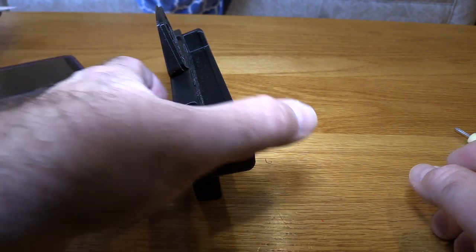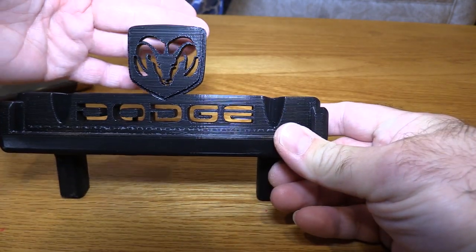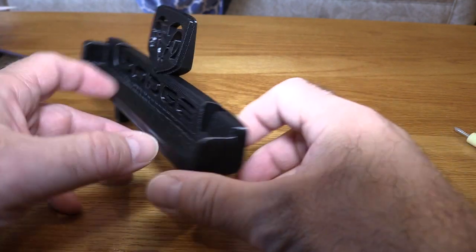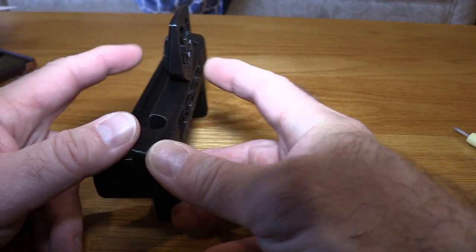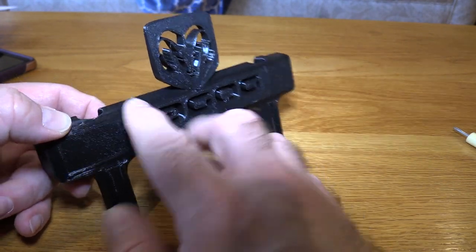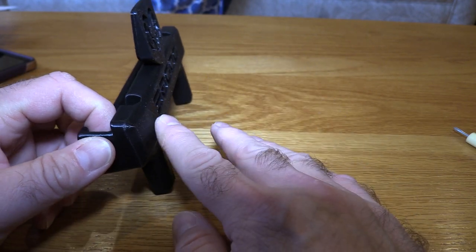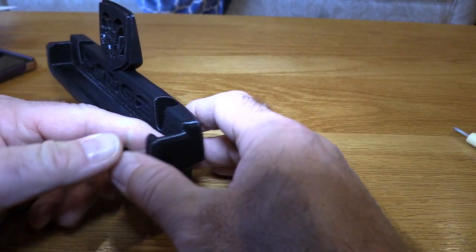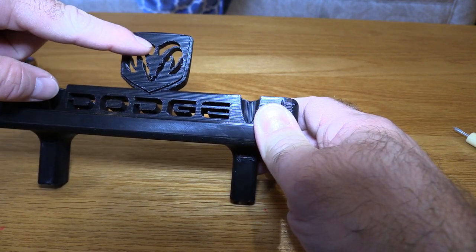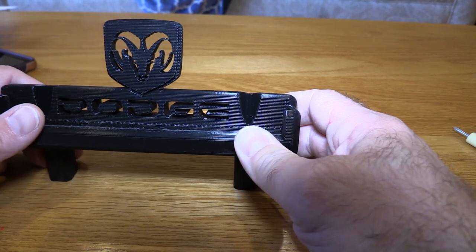Going forward — and I'm calling this next gen again — I'm not going to have this extrude all the way out. What I'm going to do is extrude it so I only need a little material on the back, like a millimeter, so it goes all the way. I'm going to start printing with clear PLA — clear isn't really clear, it's kind of muddy — but I'll start the first few layers in clear so you can still get some light behind it. I'll have to see if I can extrude at an angle or if I need to extrude multiple sections.